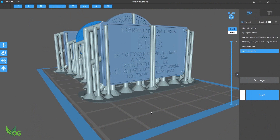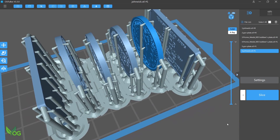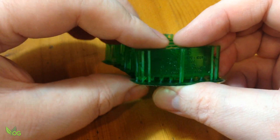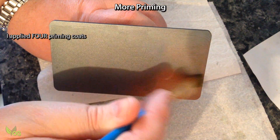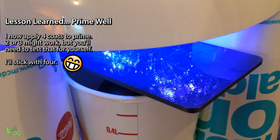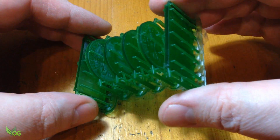This time I decided to introduce more thick support points around the patterns to act as sprues, as well as plenty of the usual supports. It makes sense to build in your sprues if you can, and the ChiTuBox software makes this easy. When it came to printing this time I wasn't so lucky — at some point the prints fell from the build plate into the resin, so the print completely failed. I reasoned that maybe the patterns were too heavy, so I primed the plate a second time, and then again and again — four times in total, UV curing between each coat. Maybe four coats is overkill and two or three might be enough, but that's something you'll need to test for yourself. Since priming with four coats, I've had no printing issues at all.